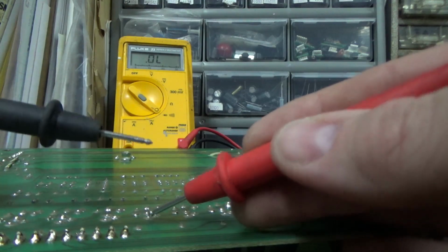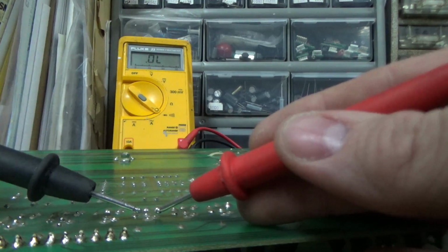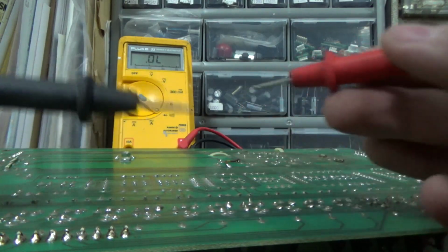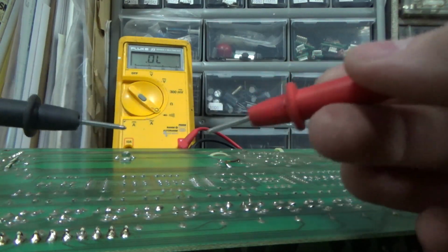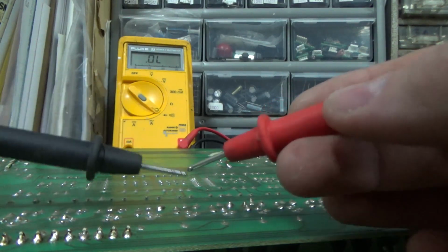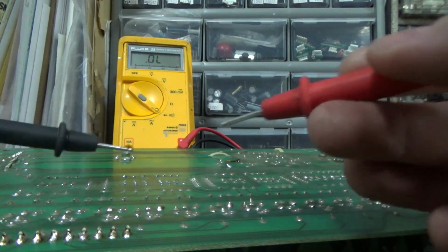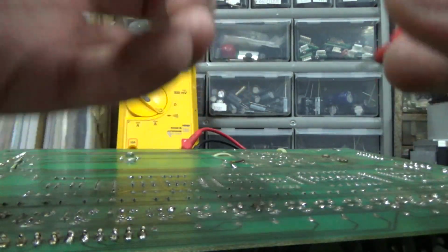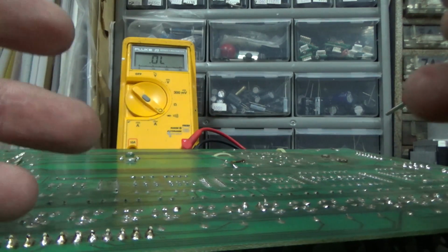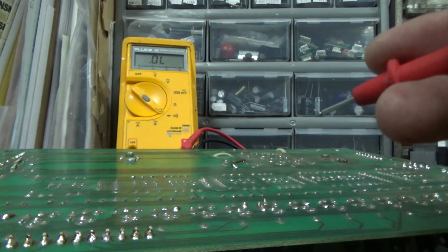And so if it's shorted, what that's doing is it's shorting that coil on, because it's shorted to ground. So these transistors turn the ground on the coil whenever the board tells it to. But this one, it's shorted, so it's always on. So as soon as you turn the game on, that coil pulls in whatever that one runs. And that coil pulls and goes, mee, and if it, heaven forbid, it's that thumper bumper, if it's that thumper bumper that's only 3 ohms, it ain't going to take long. It's going to pop the fuse. So that's why his fuse is blown.